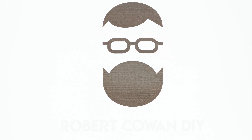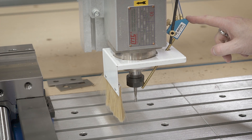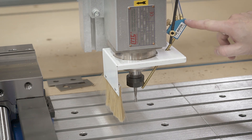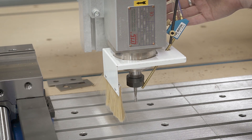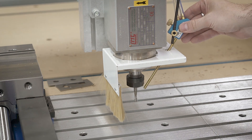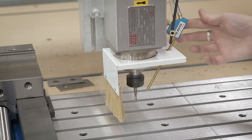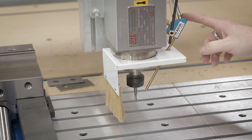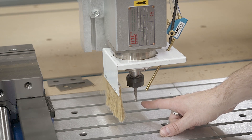So let's first start with what a fog buster really is. This blue thing right here that says fog buster — that's the fog buster. It's mounted onto the z-axis. It has a nice little adjustment, and basically what it is is a way to spray lubricant and/or coolant directly at the cutting surface or the end mill.